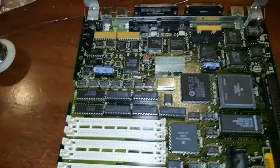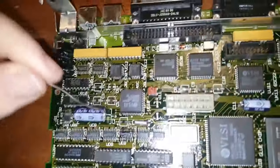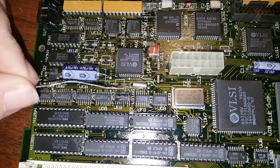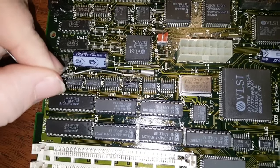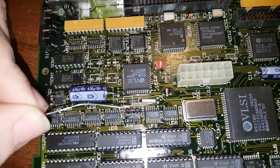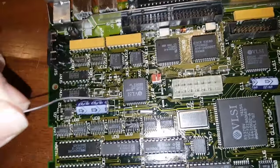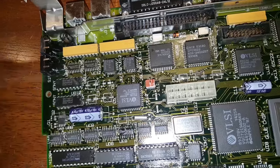Since I don't have a tripod, I can't film this directly. The technique is to reflow fresh solder with the flux, create a big blob along both sides, then alternately heat both sides with the iron until the chip is soft enough to move. It'd be easier with dual irons, but with a single iron we'll alternate until it's soft enough to pull off. Then I'll use desoldering braid to clean up the pads and throw the chip away — I'm not going to reuse it.